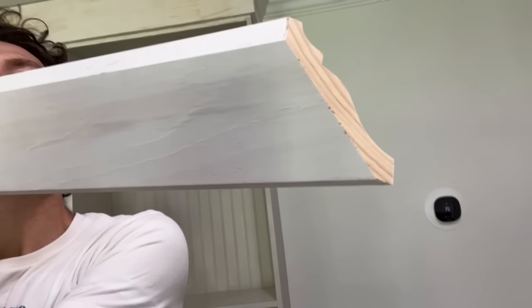You have an outside corner and an inside corner. You've got to get the actual length correct, and the length has to hit just perfectly at the bottom on both ends, even though you've got two different angles on each end. And this one, you can't even see it. They're two different angles because they're two different corners. Then also you have the angle of the actual cut — see which way the blade is going — which also has to be correct.